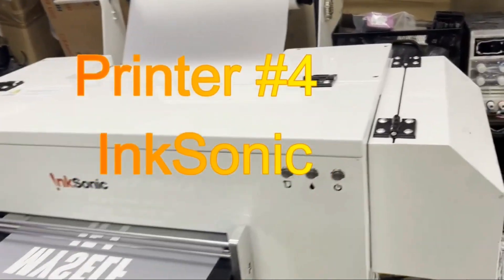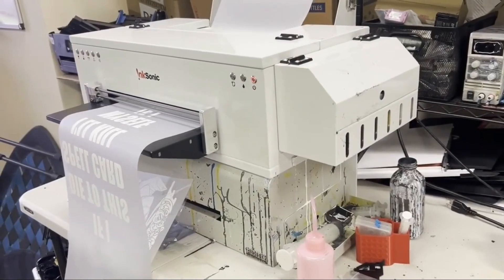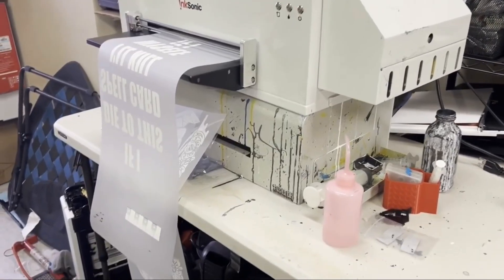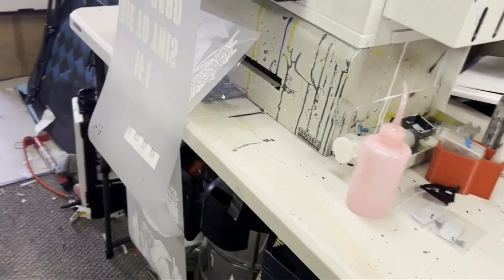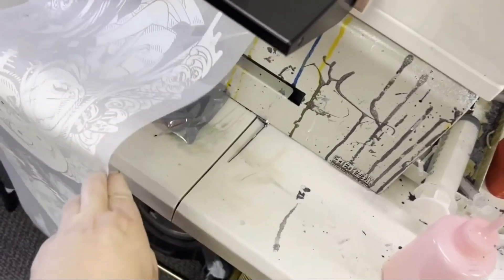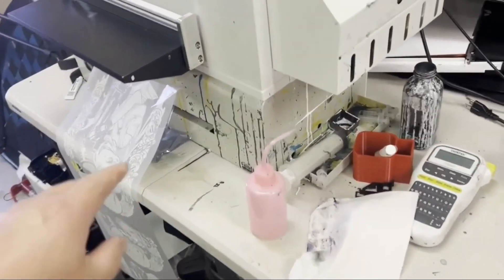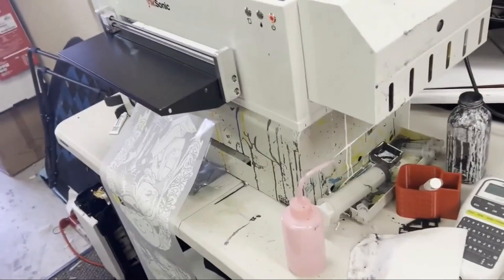Today's order is 60 shirts. For all the production printers, I rack them up so you can print one more shirt per run. When you have 60 or 50 shirts, it's important. Beside all the tools, I use a square bottle and syringe — nothing fancy. This is just a waste film to prevent the vacuum platform from sucking the print in and getting it stuck on the table. We're going to print five at a time until it runs to the floor.